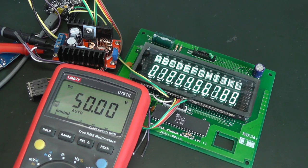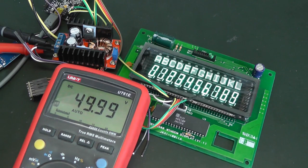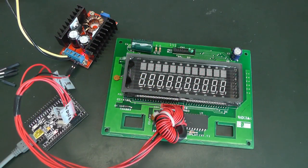What I'm doing here is using the GPIO, so inputs and outputs, and toggling them all the time, and it's not particularly efficient. And also the refresh I chose is actually not really visible to the human eye, but it's a lot more visible to the camera, which has a corresponding refresh rate. So the next step will be to improve this refresh rate a bit and also improve the code in the microcontroller. And here is the final setup.